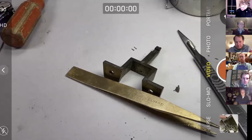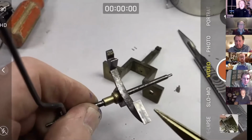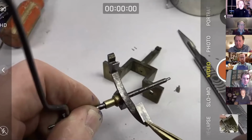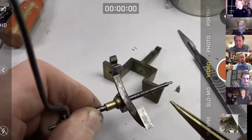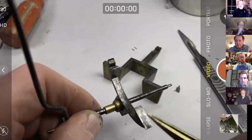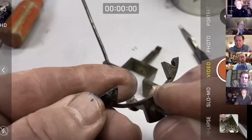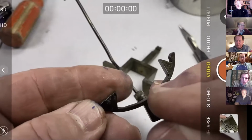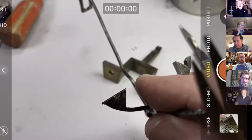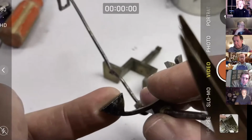Okay, right. So what we've achieved now then, we took out a bit of mainspring, we annealed it to soften it, we flattened it out, I stoned one side. You've seen this evening, we put soft solder on one side, we put soft solder on the pallets. That process is called tinning. And now we've fixed them together like this. You can see I've left it about to length here. But what I've done, look, at this end, I've left half a mil, so I can actually slide the bit of metal along a bit, and we can remove this later with a diamond file if needs be.